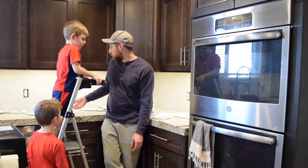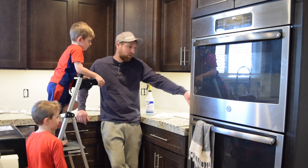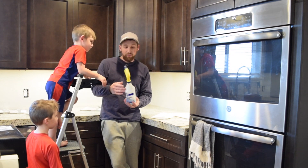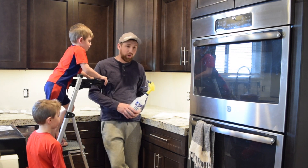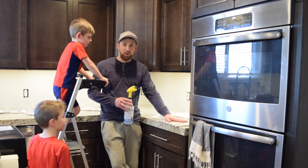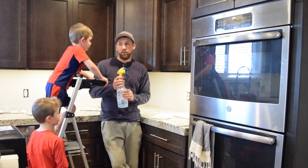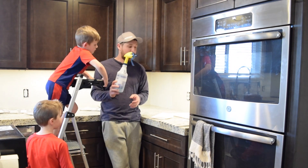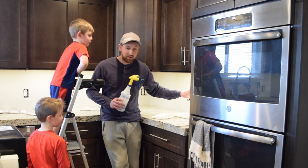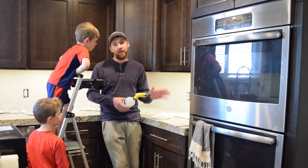Let me give you some steps here real quick. To prep your drywall to stick this on, the first thing is it has to be perfectly flat and clean. I just have some vinegar water to clean this off and make sure there's no grease or anything on the wall — then this should stick pretty well. They recommend in the instructions using a water and dish soap mixture to spray on the wall just barely, and then when you stick this on it can slide around, giving you a little forgiveness before the water evaporates and hardens.